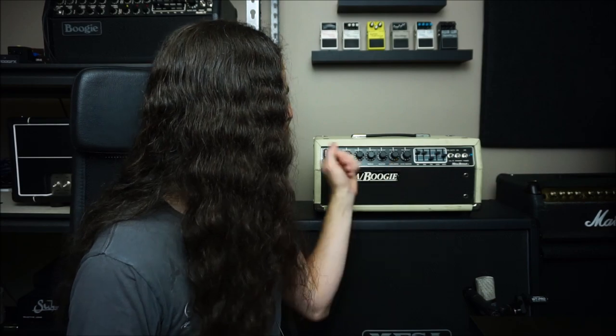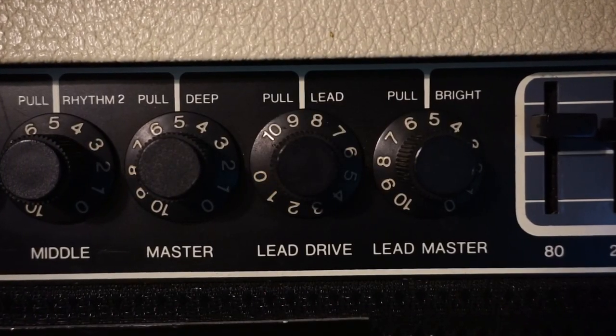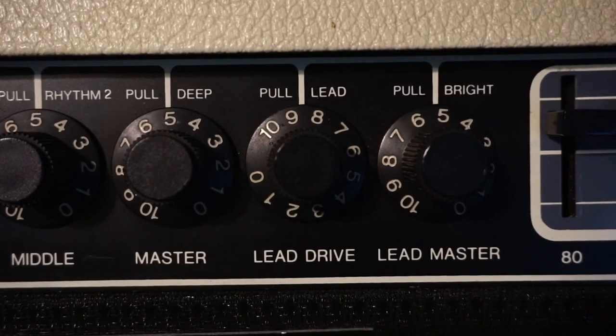But the high gain channel only really has one unique setting on the extreme mode, and again, as much as I would like to compare that across all the different amplifiers, the other modes are a Mark II C+ and a Mark IV mode anyway. Perhaps more frustrating is that they don't have the cascading drive control where you turn up volume into drive like you would on the Mark II, III, and IV, and you're limited to a single gain pot, and the drive control is essentially fixed in the circuit somewhere that the user can't access.